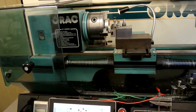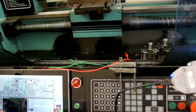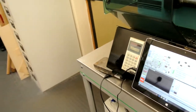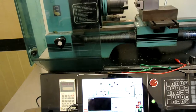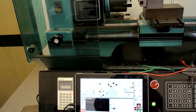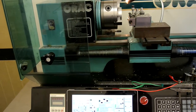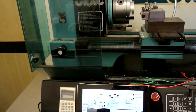So I bought the UC100, which has turned out to be absolutely amazingly good. It is the best method of controlling the lathe altogether, better than using the parallel port. It runs so much faster. Everything on the lathe works better. The stepper motors whizz along at a much faster rate than they did before, even though they're relatively small old motors, and it really doesn't seem to be any downside to it at all.